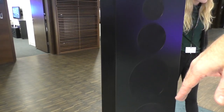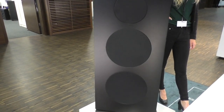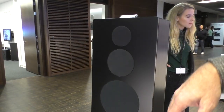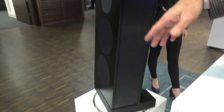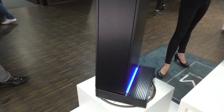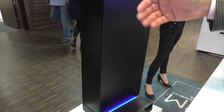We program the speaker not only to compensate room effects, but also if you have particular preferences, where you say, okay, give me a little bit more bass or whatever. And at what resolution is all that happening? Digital resolution. This is a professional module that we're using. It is comparable to about 384 kHz and 32 bits. Oh, okay. So it is a very, very high resolution.